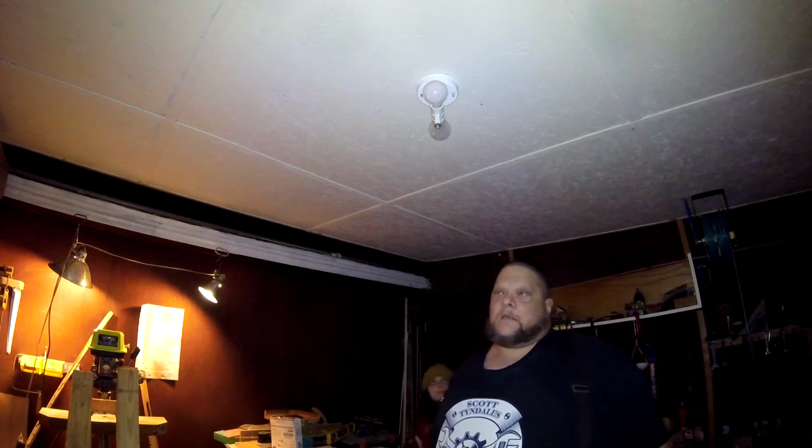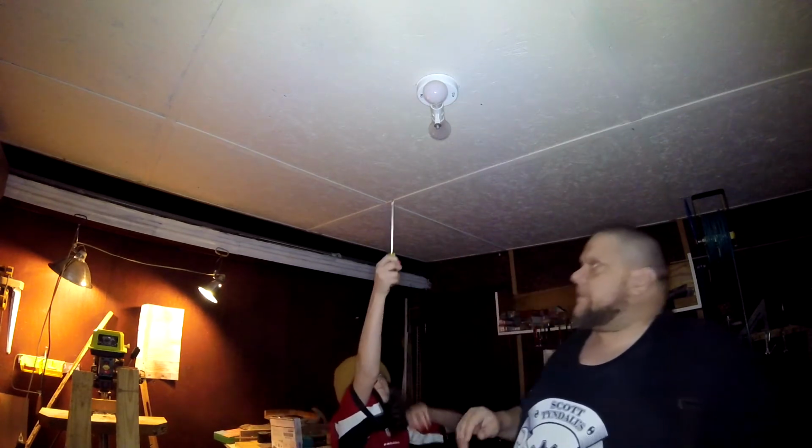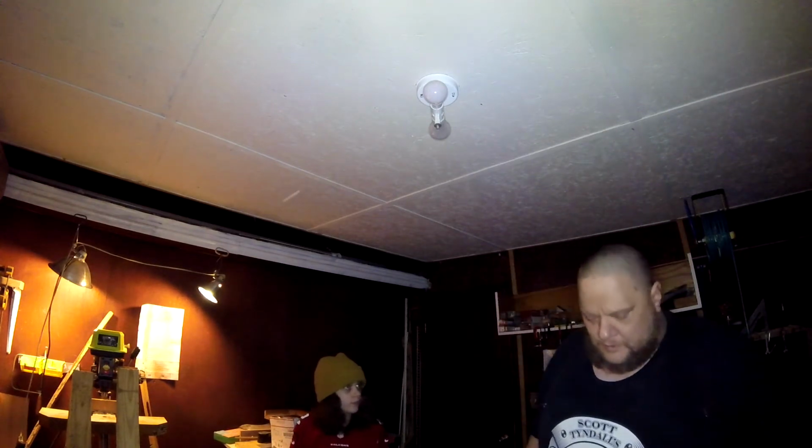That is a pop-in box, a pop-in outlet put in mobile homes. It is a stab lock design. The case on the back pops over the case on the front and stabs around the wires. Works just fine for lamps and a vacuum cleaner, nothing any bigger than that. We had it all turned off, but the problem was they said the popsicle sticks weren't an appropriate fix. Please fix it. Well, okay. That is a valid point.